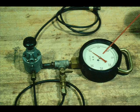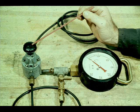Although you have repacked and reassembled the control valve, you must give it a thorough operational check before you commission it. To check it, you will need a 0 to 30 pound test gauge and a bleed type reducing regulator. The regulator will provide an input signal.